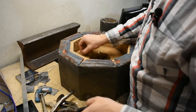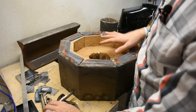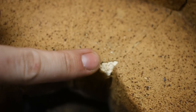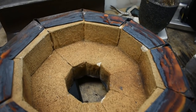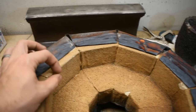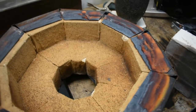So I'll just poke around, look for any loose pieces, get them out of there, probably try to clean up all the little bits of metal that are stuck in here, and then slather a new coat on. Now satanite - a lot of people use like a quarter inch coat. You can kind of see here just how thin that coating is. Here's my finger for scale - that's very, very thin. Some people make it a quarter inch thick, just for a little more strength, a little better hot face shield. Say you have the ceramic wool - that's your bulk insulation, and then you have a coating of satanite. That's the hot face - it's the face, it gets hot. Don't burn your actual face though.